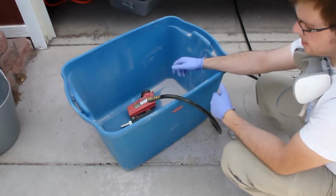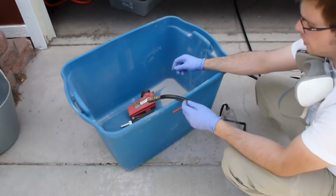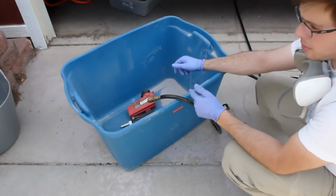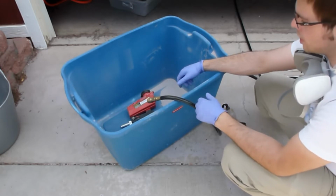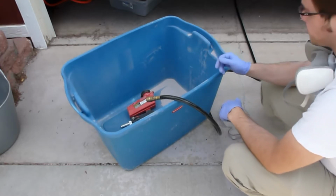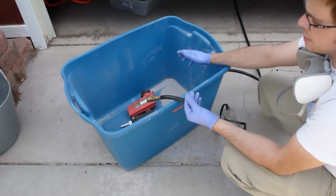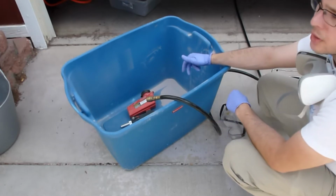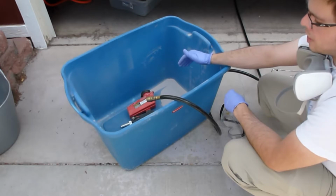It's kind of like how you would wet sand something before painting it in the automotive industry or whatever, but you're just using a sandblast gun to give it a specific texture that the paint requires to adhere. So I'm going to sandblast some stuff. Any steel, I'm doing at about 60-70 psi. Any aluminum, I'm doing at around 30 to 40 psi.